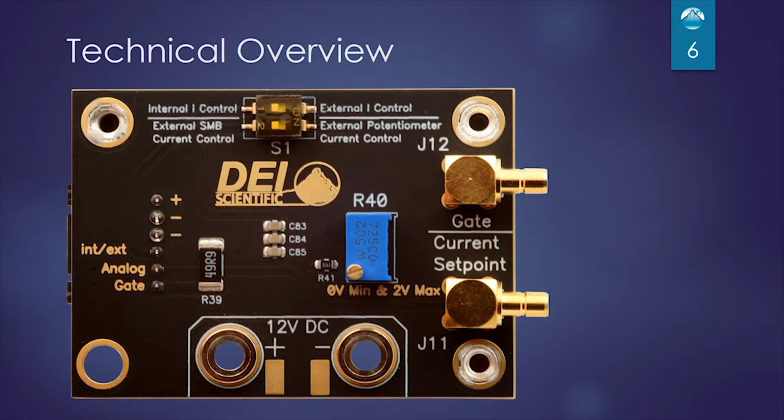The bottom shows a 12 volt input. Those are banana jacks, so you can use common banana jacks to give 12 volts to the system. On the right-hand side we have two SMB connectors, one for the gate input and one for the current set point. The current set point is an analog voltage that you can put in to adjust the output current.